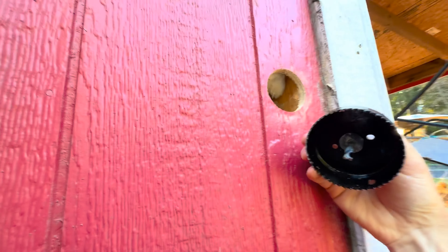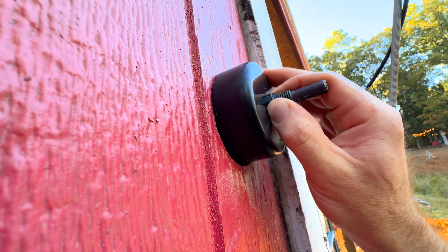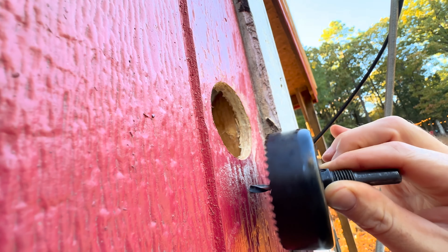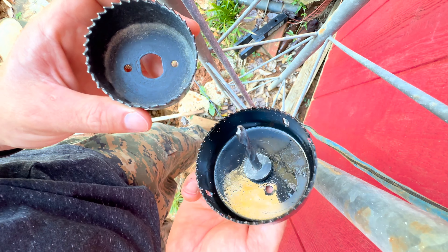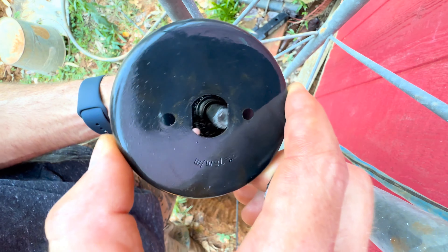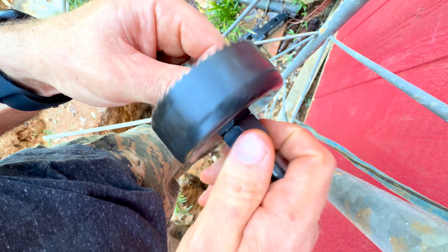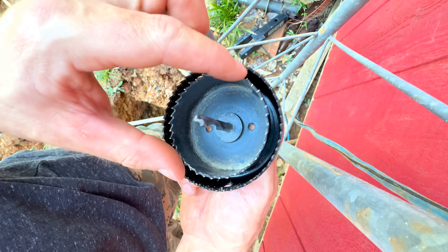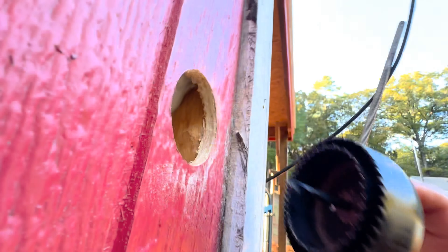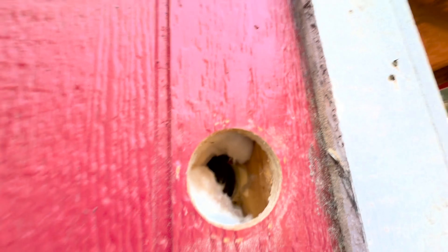But it gives me a good opportunity to show you something. If you've got a hole saw and you've already cut the hole and you try to drill a larger one, it's going to be wobbling all over the place because you don't have that center bit. How you fix this is super brilliant and super simple — I didn't come up with this. You actually put back the smaller hole saw bit and then slide the larger one on top. They nest together, and that locks in place and allows you to put your drill on there and cut the right size hole.